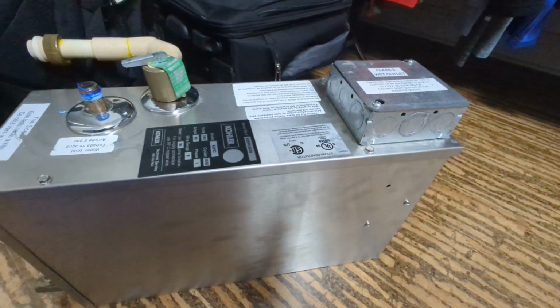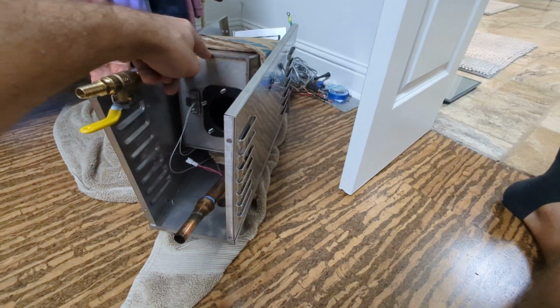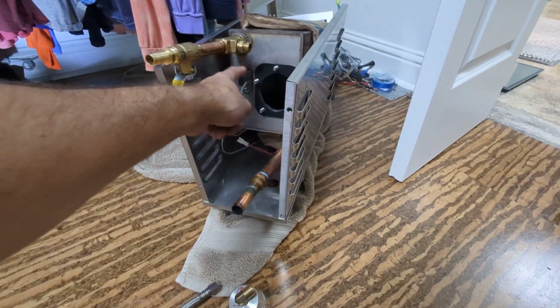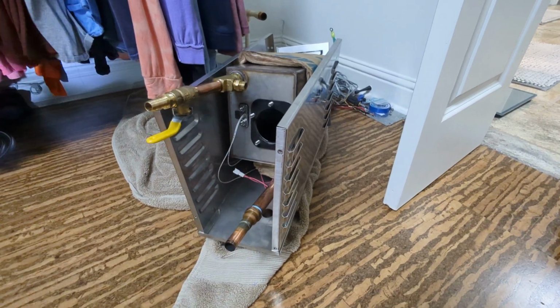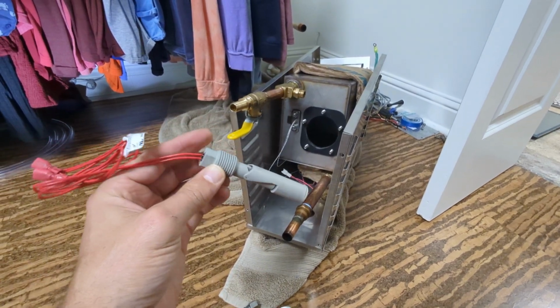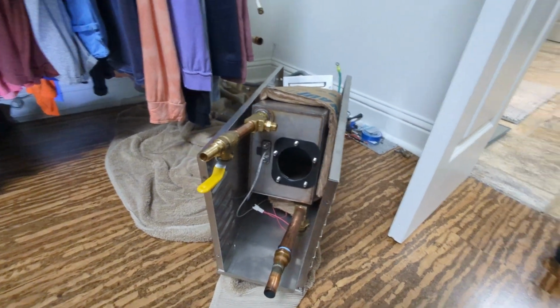This does not have a light, so it's one of the two, and I can't get the thermal fuse. If the green light is on and it still doesn't work, then it's going to be the level switch because the circuit's not complete. And that's the green light saying that the temperature fuse is engaged, just how they have it wired. And then the level switch is going to be the culprit, and you can try to find this part. Again, I got this from Thermosol for 85 or 90 bucks shipped. That's way too expensive. So that's a 12-minute ramble. I hope this solved your problems.